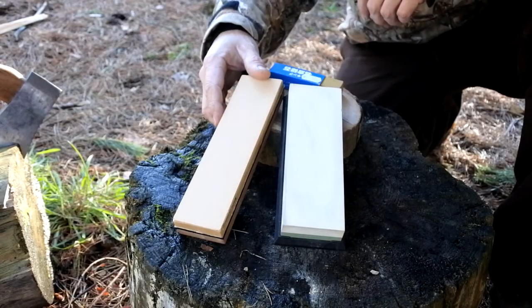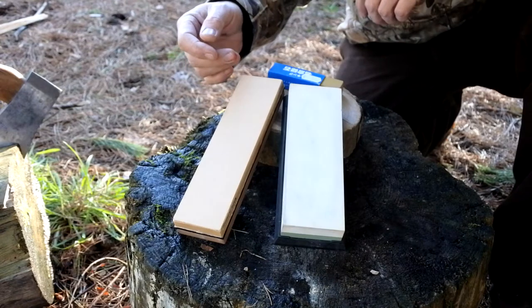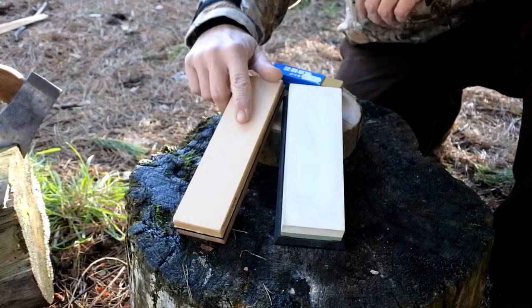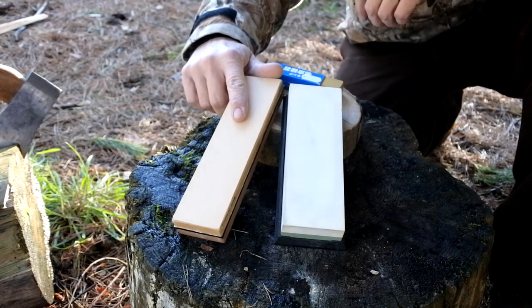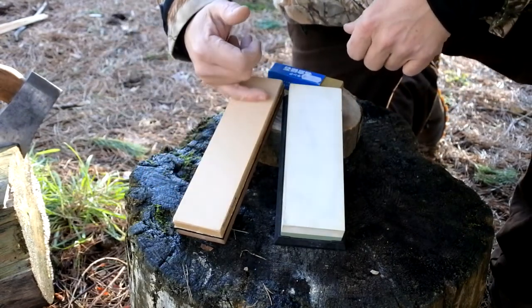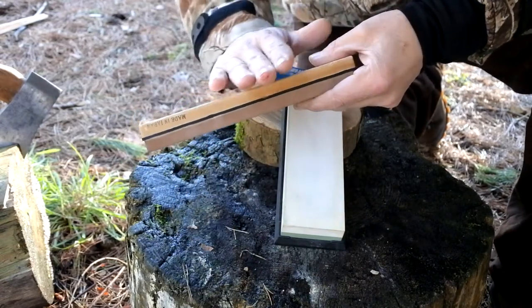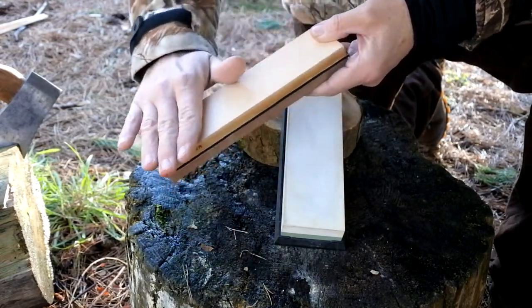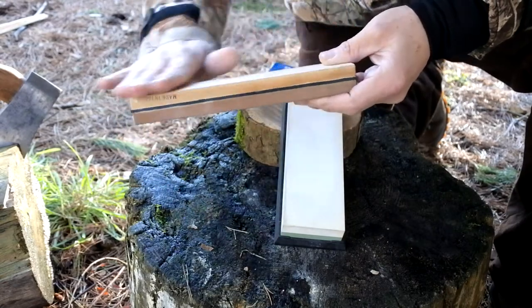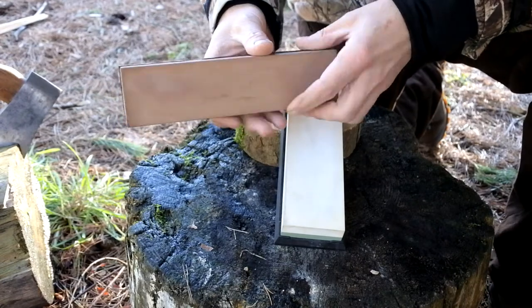So when it comes to a few of the bigger jobs which you may have to do, or perhaps I'm just enhancing a little bit of work which I may have done out in the field, then when I get in, I always put them on the Japanese water stones. These stones themselves are just used purposely for knives, so that way I can keep them nice and flat. But with them being a softer stone, they will dish over time. So what you can do is just use another stone and rub it over the top just to make sure that that profile is nice and flat. Or you can get something called a flattening tile and use it in exactly the same kind of way.